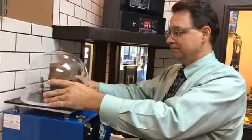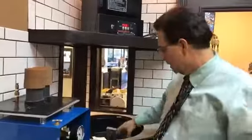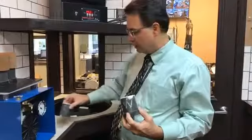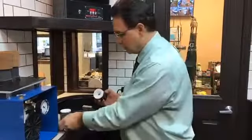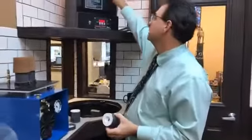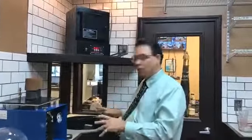As it breaks and falls down, we release the vacuum and turn it off. We'll get our bell jar off and let this sit undisturbed for a couple of hours to harden. Once it's all hardened, we'll have our two flasks — marked R for rose gold and W for white gold. We break off the bottom base, so the ring is now trapped inside. We put it in our oven here, which heats up to 1350 degrees. It'll go through a burnout cycle of about eight hours, slowly rising up to 1350 and then dropping back down — all that wax melts out, leaving an empty cavity ready for us to pour the gold into.